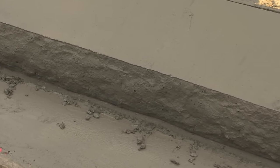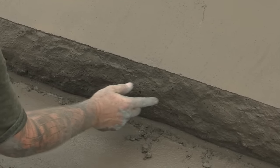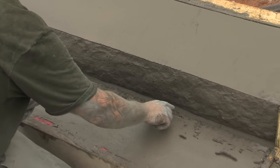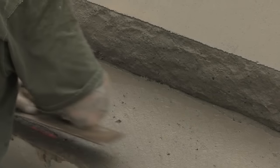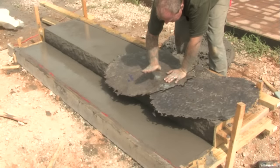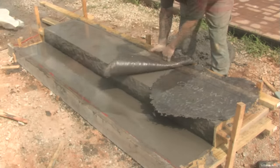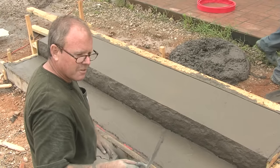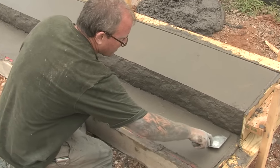We did a decent job of vibrating it. We have just a few minor little voids here, but nothing that's unacceptable. Here's the area I'm talking about — so I'm going to get a hand float and get in here and address this. From here you could either leave it slicked out or you could actually texture it too to make it look like rock. Now that we've floated out our little depressed area from the step liner, I like to use a little duckbill trowel and come in here to really finish this area off nice.